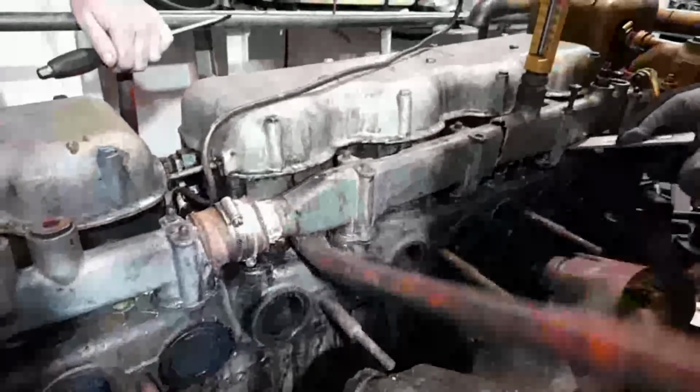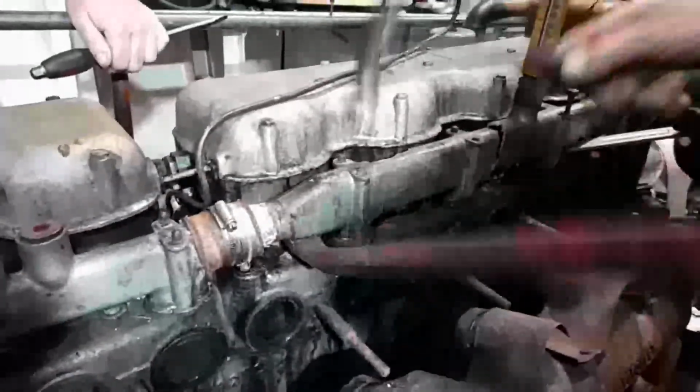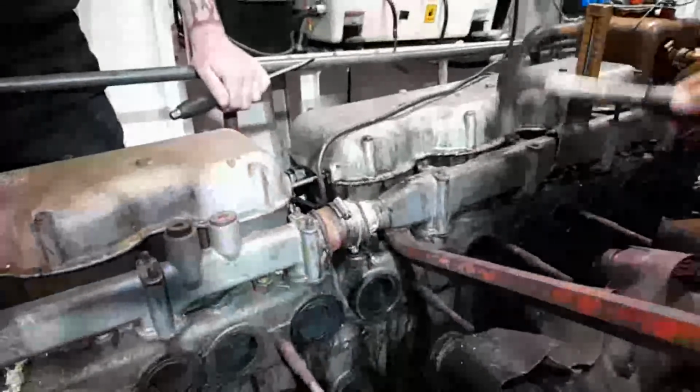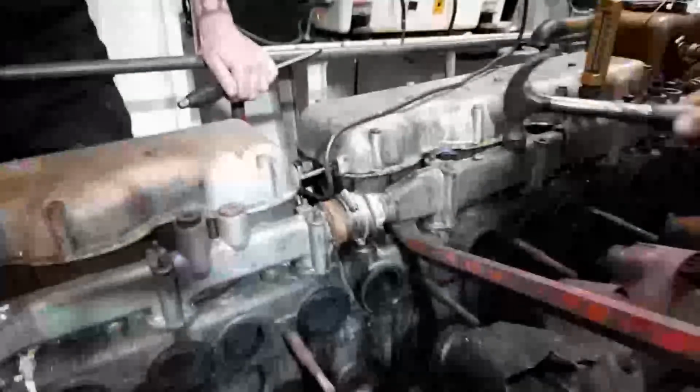Our initial attempts are, of course, to simply tap the water rails and try and prise them up in such a way that we can save them. Not successful in this case, I'm afraid. Here you can see that we've given up trying to lever, and we're simply using a cold chisel. With a small angle grinder, we cut a slit down the side of the stud.